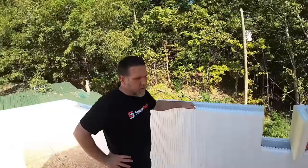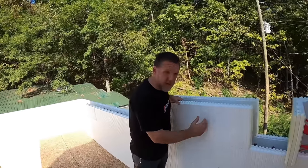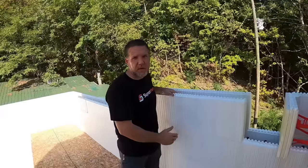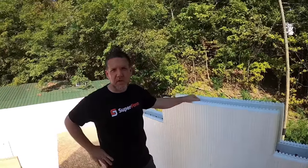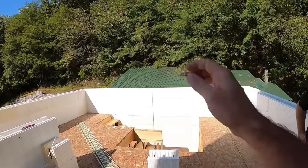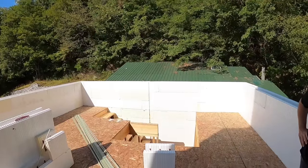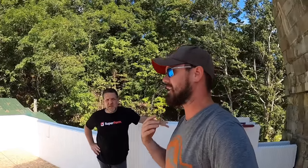Each course would alternate where that stud lands. So potentially, your drywaller, if they were using that stud to fasten, then they could be upset. Really, that's the main thing we're trying to do, is make it easier for the next guy to follow. That's right. And even on these commons, we still mark that out. We still have the conversation with the next guy in line, which here at the castle, I'm the next guy in line, so I don't have to have that conversation.